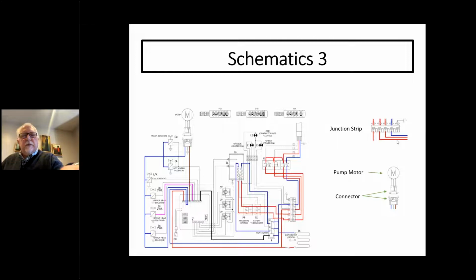You can connect it there, but you can't connect it anywhere after there, because that whole ground circuit has to be untouched and pristine. You can't mess around with that. The same thing happens if you switch a ground and a neutral in a plug. Technically the machine will kind of work, but you're using your lifeline, your safety feature of the electrical system of the house, to actually do work in the machine, and it's not performing its function as a safety feature. And the other thing is, that ground wire is connected to everything in your house or your business. So you don't want to mess with that.